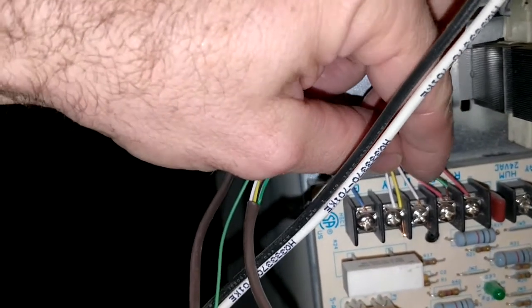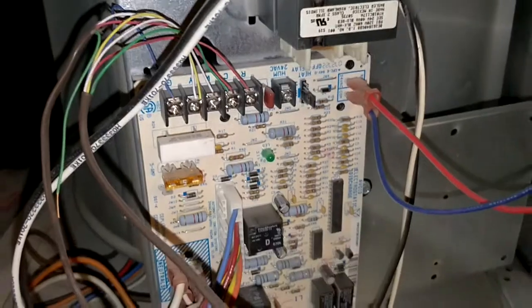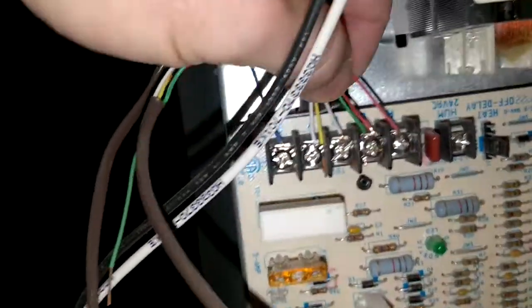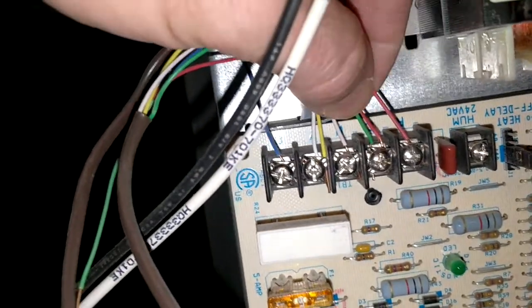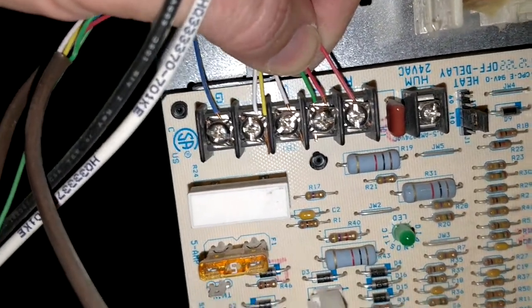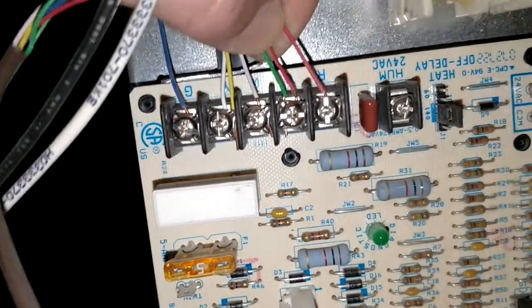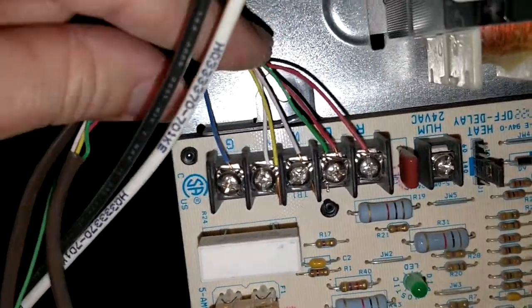It can be on the same side or the opposite side — just get her in there to stay. You can see that green wire is in there on that terminal now. I've tightened it down — make it really snug but don't smoke it down. Then give it a tug to make sure none of these wires are gonna come out. Check them all since you're in here.